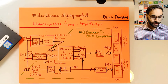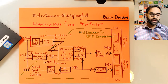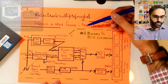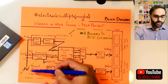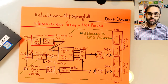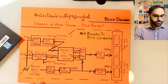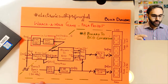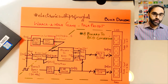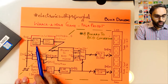Let's look at the block diagram. This is actually a very small project and the reason I say that is because a lot of components of this project we have done before. If you look at video number 8 on my playlist — binary to BCD conversion — what you see in green dots, this part of the functional block diagram is copy-pasted from that video. I just imported all those source files from binary to BCD conversion and pasted them over here. All I'm creating are two new modules: one for the score count and one for the timer. The timer starts downward from 20 all the way to zero and stops there. This part of the circuit takes a one-second clock which is fed into the timer count.